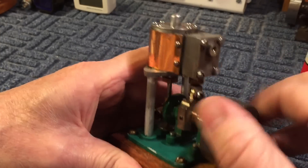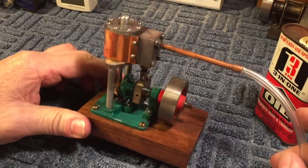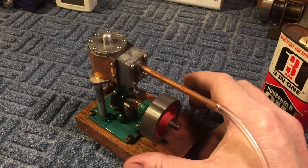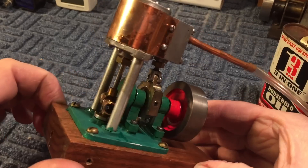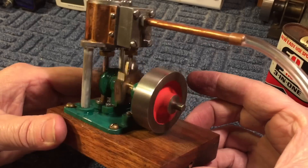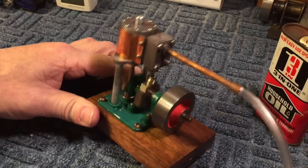There's going to be an intake and an exhaust — this is the intake here. Run it with your fingers back and forth until everything's nice and smooth, then hook up your airline. We'll just add a little bit of air and give it a turn. And there we go — it's running nice. This is a special T engine. It hasn't been run in probably a couple of years, but you can see it runs very nice. And there's the compressor in the background. That's how this engine runs — that's all you have to do. I hope, Ben, you get that twin of yours running — it looks like such a nice little motor.